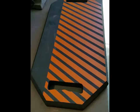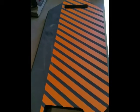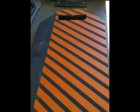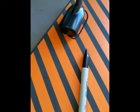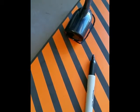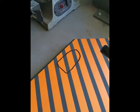We have here a knee pad purchased from Bunnings for around $10. It's made from high-density foam. This is going to do the job very nicely to make a support for our transducer and to be able to mount it firmly in the hull. Firstly, use a marker to trace around the outline of the transducer. Using our multi-tool, we will now cut out the block that we've just marked.